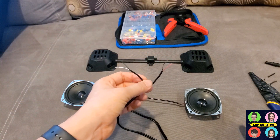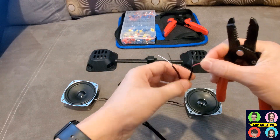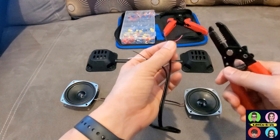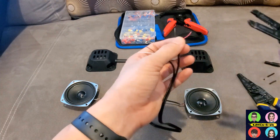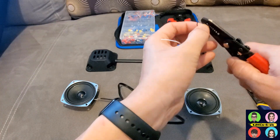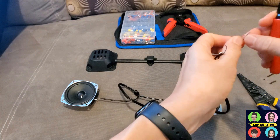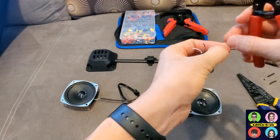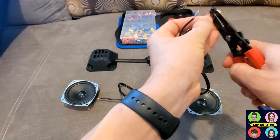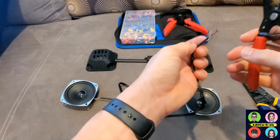You have black and red speakers for one side, and black and white speakers for the other side. These are super tiny wires, so we need to expose the wire — I have an extra set of wire strippers that go smaller than the big set. We're going to expose some wire and then add some ferrule crimping tubes to tie it directly into the amp, to make it a little cleaner and ensure it stays snug.